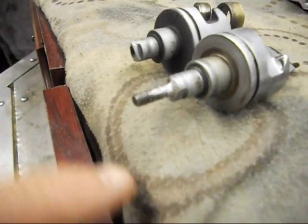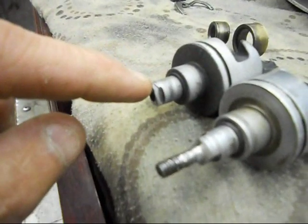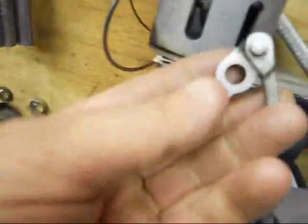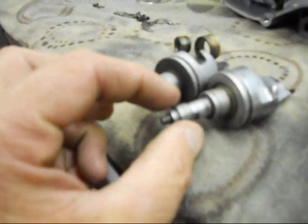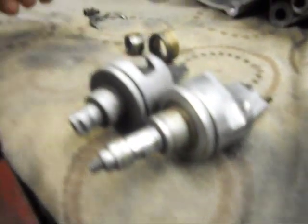I had to machine it myself with basic tools — fabricate the new one basically. This thread here went inside some aluminium that I had to file down to get back to that dimension, to be able to get it to sit on there properly and hold the spring and keep it away from the end. It can be done with basic tools — you don't need to get it machined. Just use a two-edge file, round it off, keep trying it until it slides on there so you can get a locking nut on the end to hold it together.